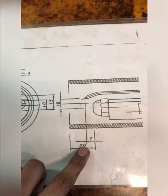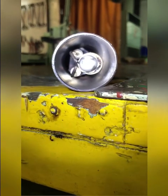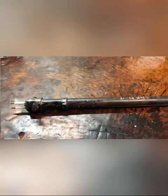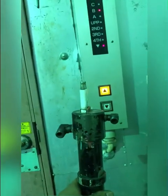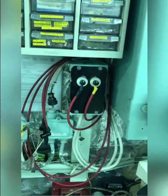The last distance is 20mm — from the nozzle tip to the barrel. Check that this electrode is far away from the barrel, otherwise there will be a spark between the electrode and the body. Now it's time to test the pilot burner. Using this testing machine, you can see the spark — the spark is between the two electrodes, and the arc is moving towards the nozzle.